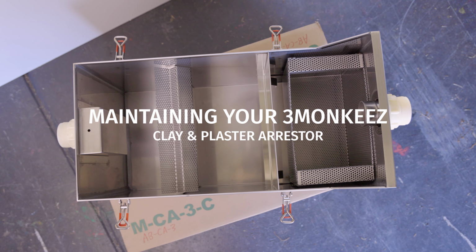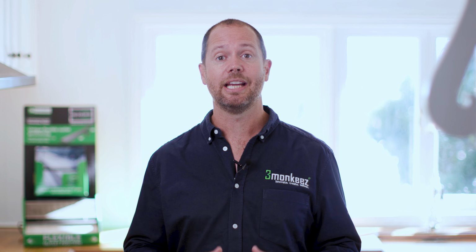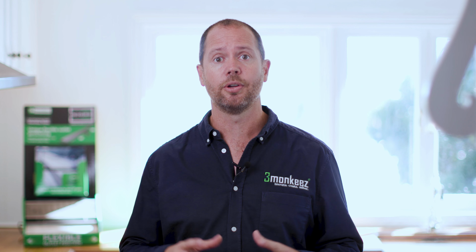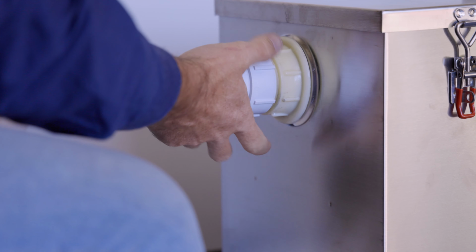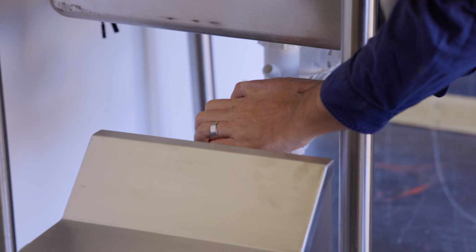Maintaining your 3monkeez clay or plaster arrestor. It's important that you clean out and maintain your clay or plaster arrestor on a regular basis. Disconnect the outlet of your clay or plaster arrestor, and if you've installed a valve, turn it off.